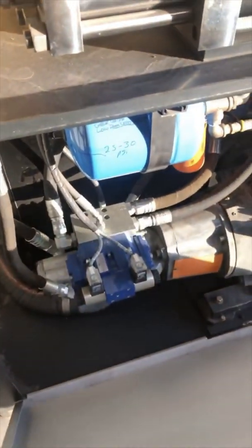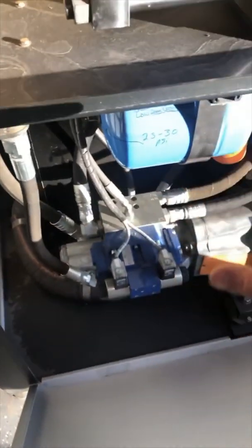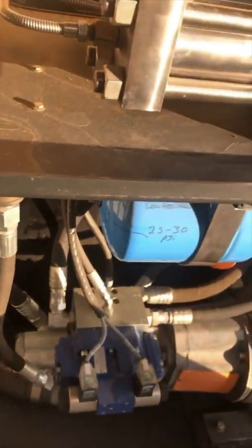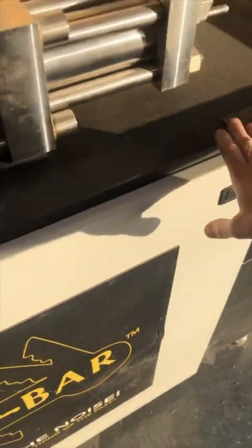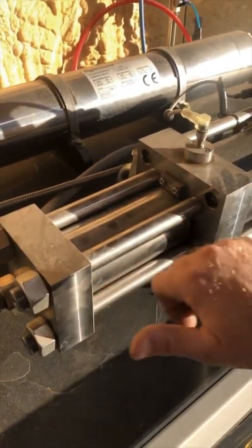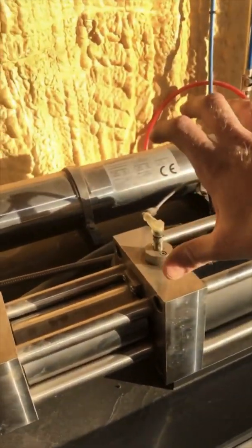What we have here is basically a big hydraulic pump. No issues down here at all — hydraulics works great, big motor. This is a chiller; you have to cool the hydraulics, so we have a three-ton air conditioner that runs glycol through the lines and cools this block, which in turn cools the hydraulics. There's a big tank in the back. This is an intensifier pump — 20 to 1 compression behind a ceramic cylinder. The hydraulics are slamming that cylinder and creating 60,000 PSI going into this accumulator tank, which just holds that pressure.